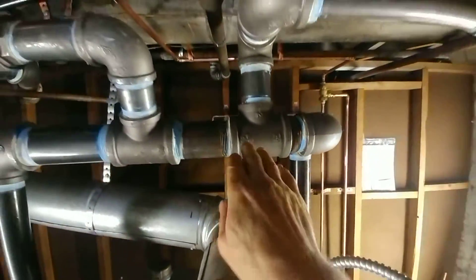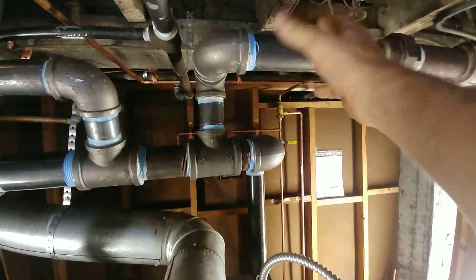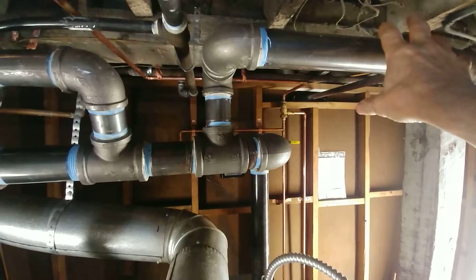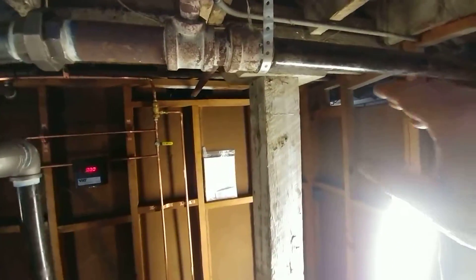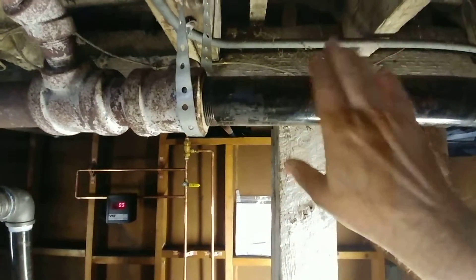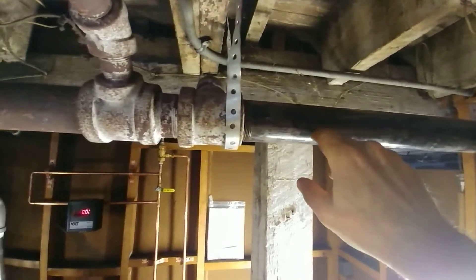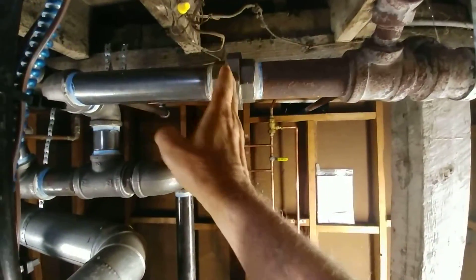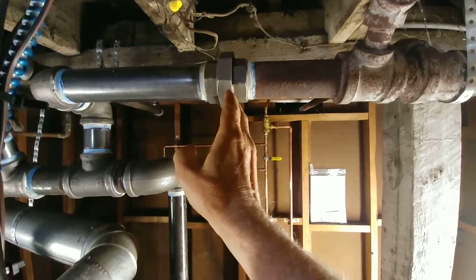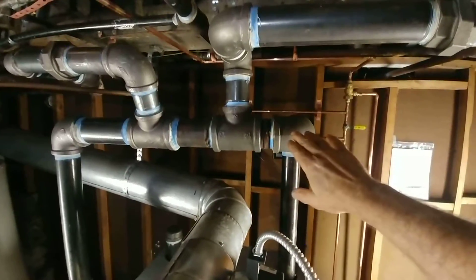In this particular case we have a take-off here, and this is parallel flow now. We had to raise this end up because this was hammering so much that over the years this pipe had to be replaced by others — they did a pretty good job and at least used threaded steel. This is the original piping, and this is where we cut and thread the pipe to put the union here and tie into the header.